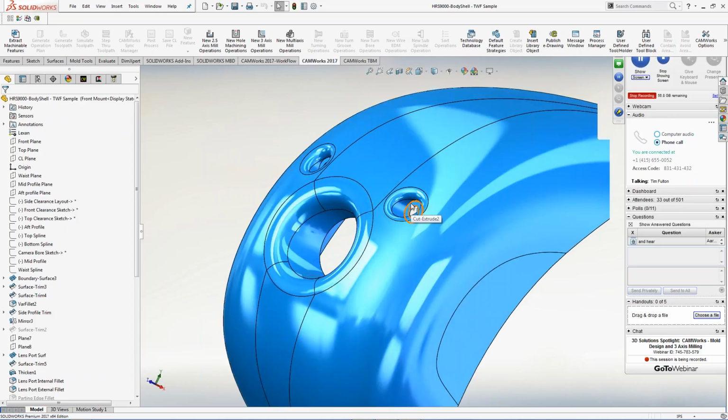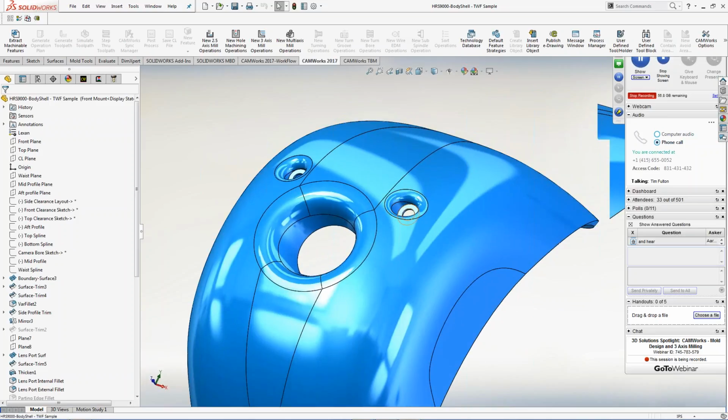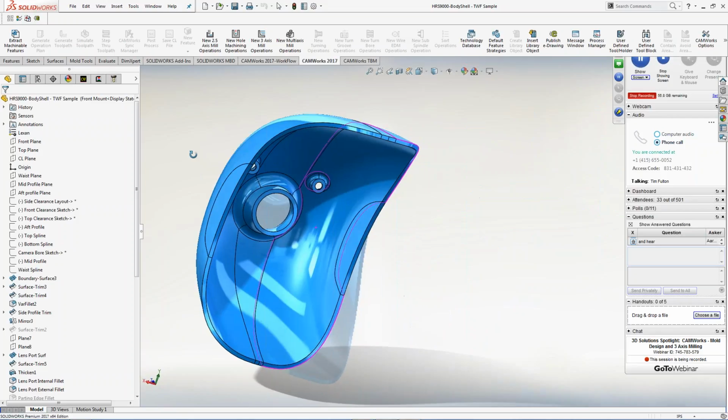This looks not bad because this is an external radius, right? So the hard part about building the mold is what's internal, what's external, stuff like this. If I was going to cut this, here, it'd be difficult because I couldn't actually make this fillet. But you got to remember, this is a reverse side of this actual part. So now we want to turn this into an electrode so we can throw it on the sinker and then put it in the wire EDM machine, or the EDM machine, sorry.